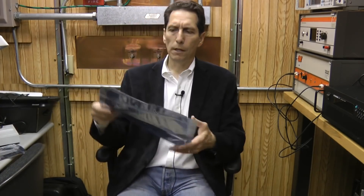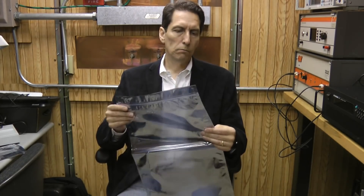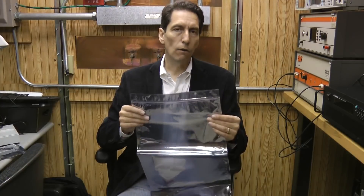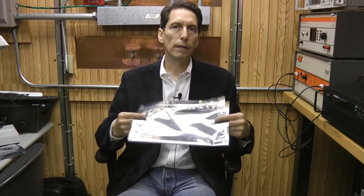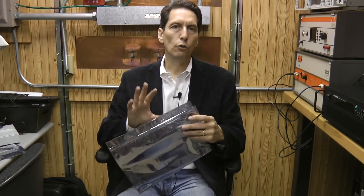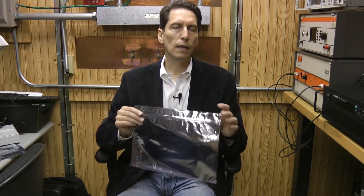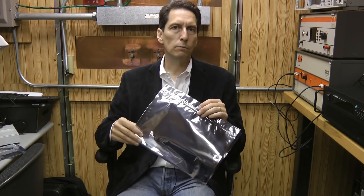With either of these bags, since there's a metallic liner inside, you might want to pay attention to not putting exposed electronics — with a metal antenna or an exposed charging port — directly against the inside of the bag. The Survive Tech bag actually ships with some conventional anti-static bags. These particular ones have a Ziploc top which, in my testing, haven't done a great job of shielding by themselves. But when combined with another bag you get two layers of protection, and they would do quite well. The advantage is it gives you an insulative layer between your product and the inside of the bag.